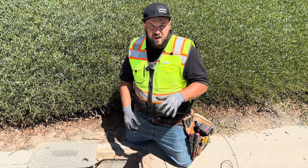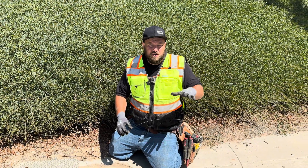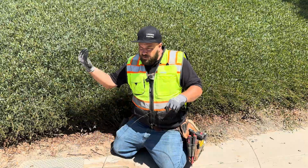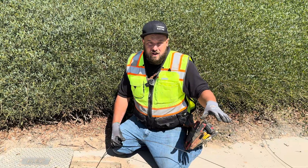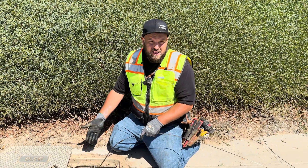What's really important here is there could be other electrical equipment around you if you're doing this, and you want to make sure that you don't send a metal fish tape up into a transformer or a switchgear or a panel somewhere. If you don't have any live electrical around you, an easy way to do this is to just get a vacuum and blow in the conduit.